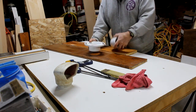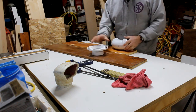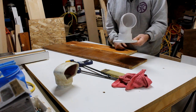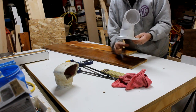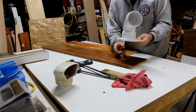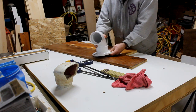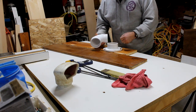So you can have a little piece sticking up, and then you have a baffle in between. This piece would be on top of the Dorade box with your cowl vent, and with a baffle in between and a little piece of pipe sticking down this way here, water can't get up and over the baffle and then down below into the cabin. Again, I'll put together a diagram so you can see how that works.